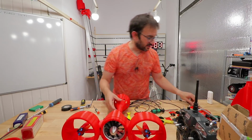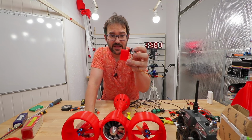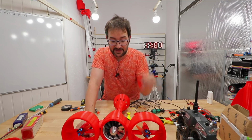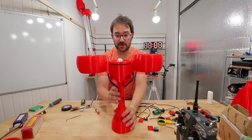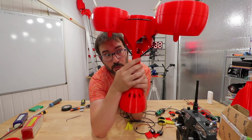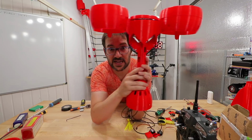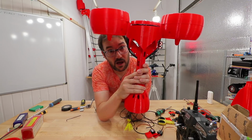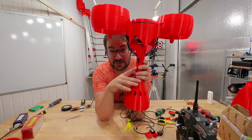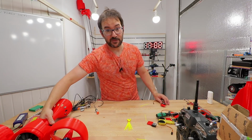So I will try and use one of these HELI gyroscopes with these very high speed servos that had these kind of rudders on them, and that will be controlled by the gyro. And I plan 3 stages of servos. The first ones on these holes in here are the ones that will try to counter rotate the EDF, and then there is another stage in here and another stage in here to move it sideways and forward and back. Hopefully, but this could even not go straight up, so that might not be even important. The next thing that I need to do is to wire all those servos, so let's do that.